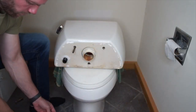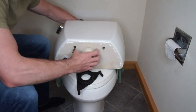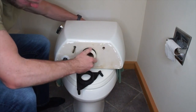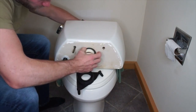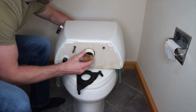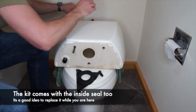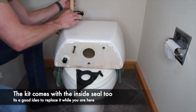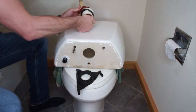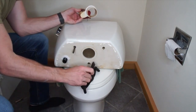The seals usually come as a kit with the bottom seal and the top seal. To get to the top seal we'll need to remove this big nut off of the bottom. Behind that nut there is a slip ring — that is important. This slip ring that I'm removing right here, that's important, so hang on to that. It's not trash. Then you'll pull that whole overflow tube out the top. This has the top seal on there — you can pull that off.